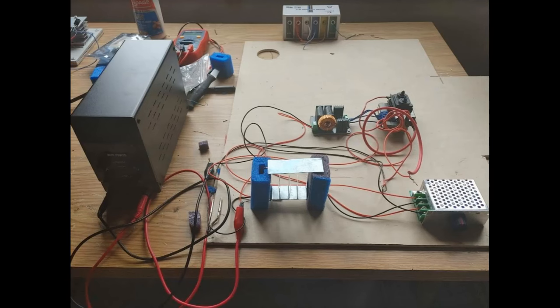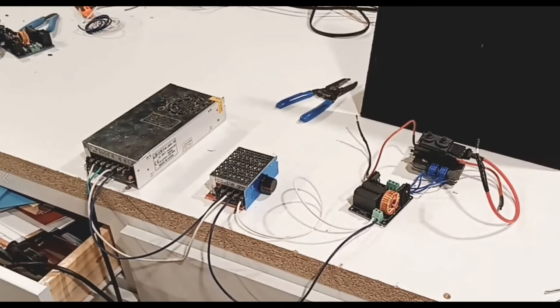So let's take a look at the power source for these last two experiments. As you can see, it's a lot less powerful. It's no longer the voltage multiplier on an AC flyback, but instead it's a DC flyback, and we're able to adjust the actual amount of voltage going in. When you're adjusting the voltage here, you're reducing the amount of amps going in and you're bringing the voltage higher. Let's take a look at this circuit more in depth.